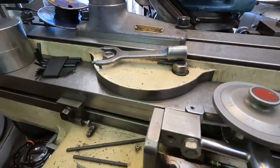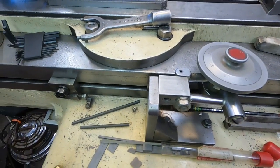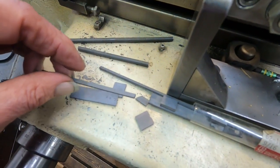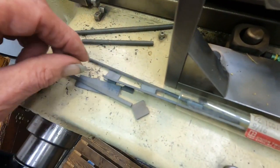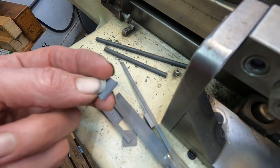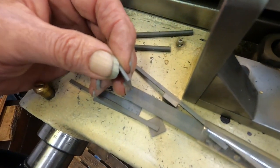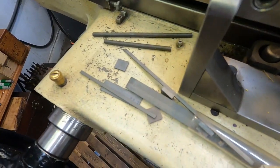To use carbide shapes, you can get it. This carbide here - you can break it off, but it's really a lot nicer to be able to saw it off. You see this carbide blank here - little different thicknesses. Like a piece like this, you can actually stand it up. And that's about a sixteenth thick. So you can make a sixteenth inch thick grooving tool, shallow parting tool, and all kinds of tools.